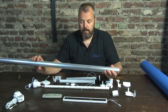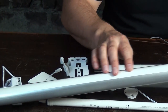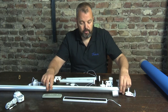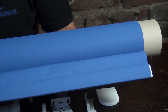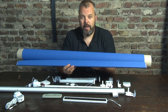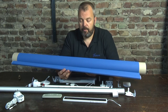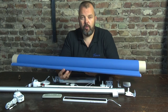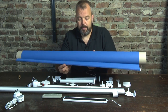You need a tube to fix your fabric onto. This is an aluminium tube, 38 millimeters in diameter, with a double-sided adhesive strip, so it's easy to connect the fabric — you just peel this off and the fabric will be fixed to it. You can either buy fabric yourself, we can provide one, or you can take an old roll-up blind and use that fabric. One thing to make sure is that you have some sort of weight as a lower bar — that makes it easier to roll the system down, helps it roll smoothly, and keeps the fabric perfectly flat. Without weight in the lower bar you can get waves in the fabric, which is something you'd rather prevent.